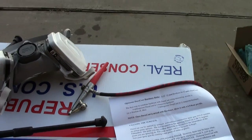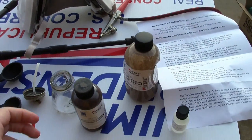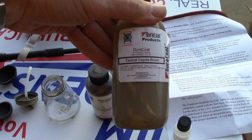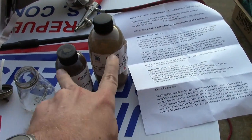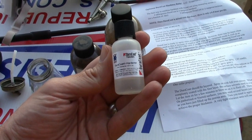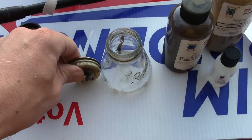Here's some of the safety equipment we'll be using. And here's the actual stuff: I will be doing a 50-50 blend of Tactical Coyote Brown and Tactical Woodland Brown. That's going to be 12 parts of that blend to one part of Duracoat Hardener. This is an epoxy, not a regular paint. All this stuff is going to be mixed right in here and then attached to the airbrush.